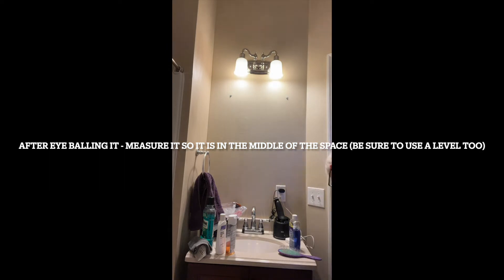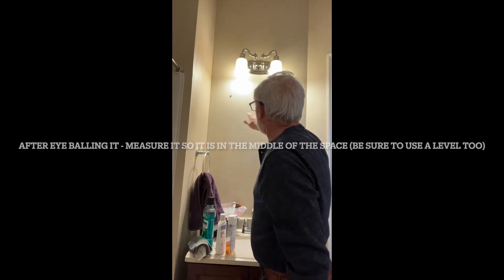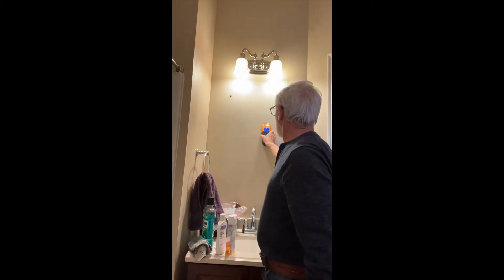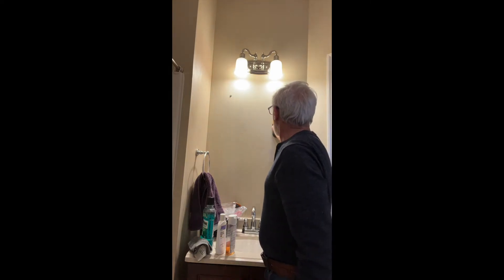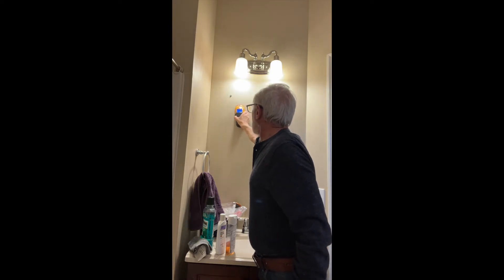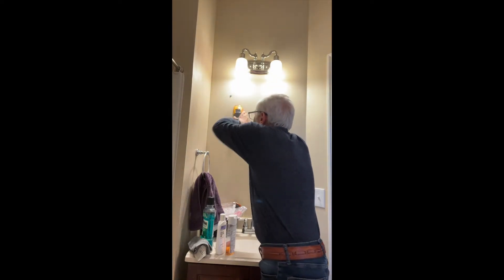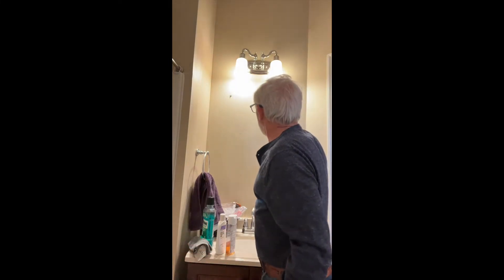All I'm going to do is take the old bolts out that were there, clean it up, then find where the stud is — got a stud finder here. There's one over here, and another one. Can you see what's beeping? The red light is on — the stud is right there. So one of them is going to get bolted in there, and there's another one 16 inches over.